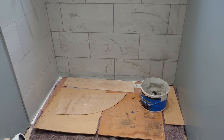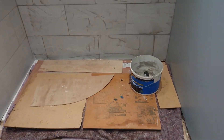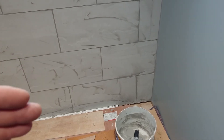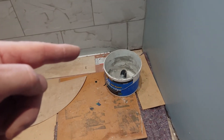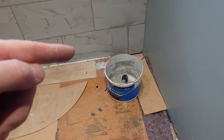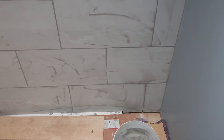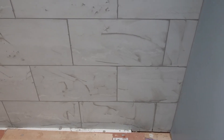I'll show a little bit of a clip of the shower tray when I finish the grouting. When you start getting hollows behind the tile where you've had to pull them out because the wall's not flat, I like to go in with a fairly loose mix of grout first — go over the whole area and really push it in. Then when I've done that, go back over with a slightly firmer mix, which pushes that soft mix back in and packs the gap nice and full with grout.